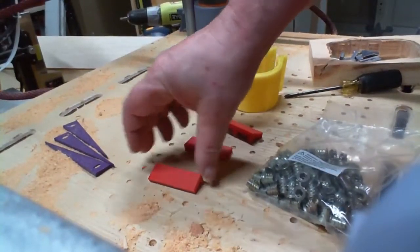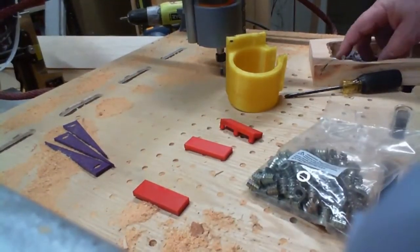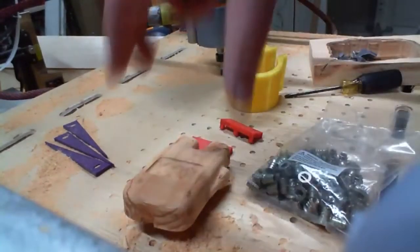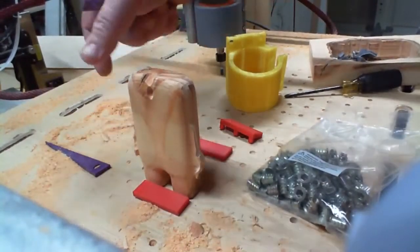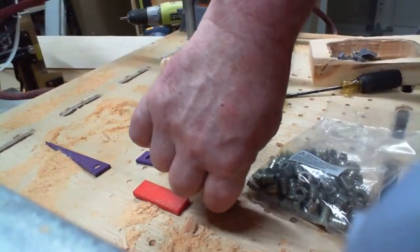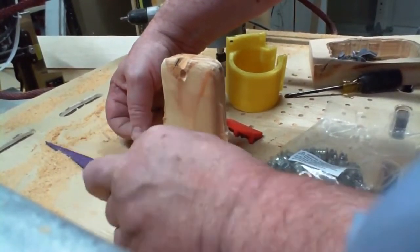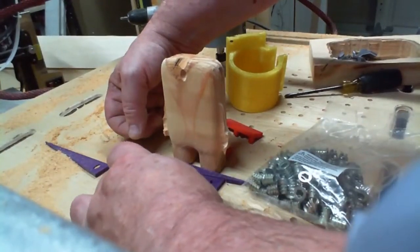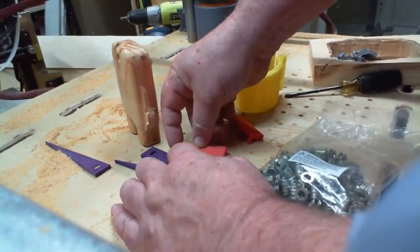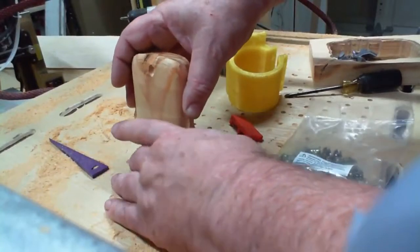So what you do is you put a block, and put a block, and then whatever you wanted to machine, let's say a little piece of wood. You put your little piece of wood in there, and then you'd put 2 of these wedges in and drive them against each other to wedge the part in there. So like this. Obviously, I'm not going to machine it standing up like that, but if I couldn't reach it that way, then I'd put them this way. If that still wouldn't reach, well, then I'd have to rearrange and get something. And these work okay for flat stuff, just straight on the deck.